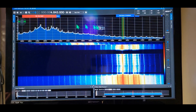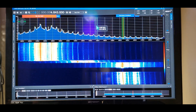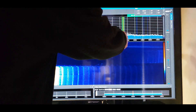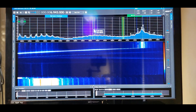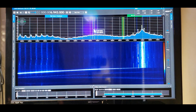The one we were just looking at — the simple homemade one — is not bad at all. That thing's going to resonate on at least three to four different bands for you, plus you're going to pick up shortwave in between. Let's scroll up to 40 meters and bring our capacitor in. There's the back side of the capacitor, and there's our resonance — you can see the signals coming through. That's where I like to leave mine.